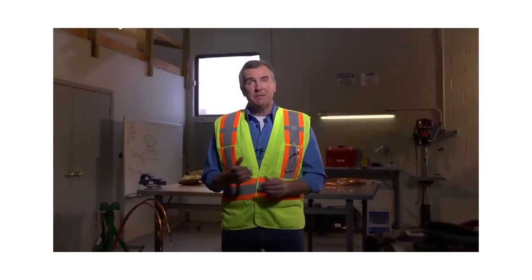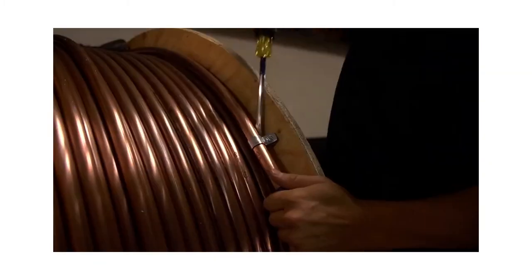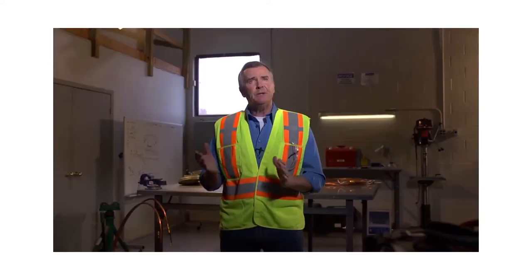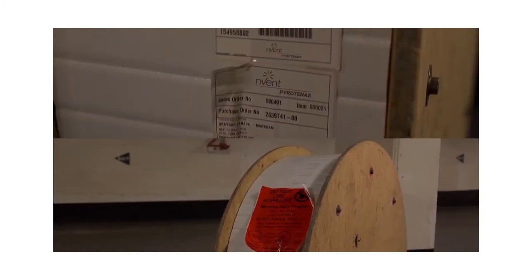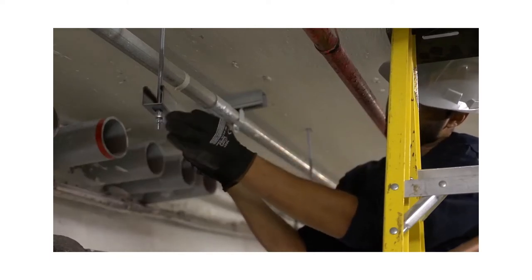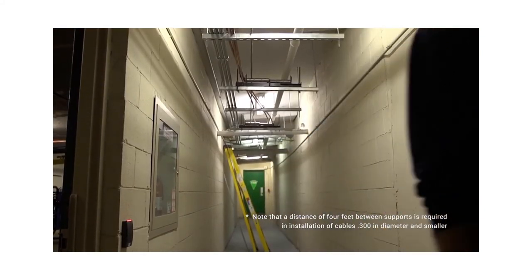You may be familiar with this following step as it is common practice with many commercial cables: place the MI cable reels on jacks at the bottom end of the run, making sure the pull is over the top of the reel and having good clearance below and on the sides of the reels. This way it can turn with ease as you pull the cable. Remember that each cable reel comes with complete detailed information and installation instructions that need to be carefully read and followed. Next, install your supports along the full length of the run, every six feet both horizontally and vertically. The cable will be secured to these supports once the pull is complete.